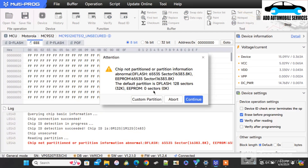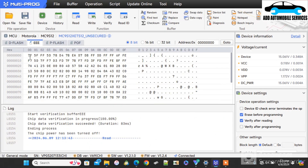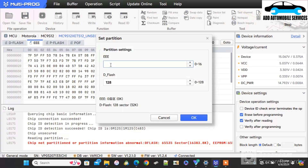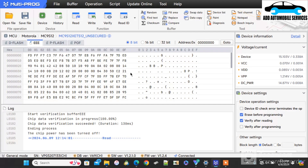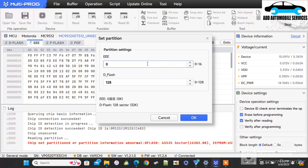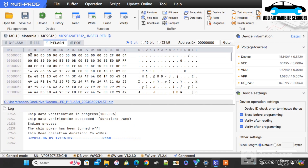When you are reading the EEPROM it tells you to partition it. Every partition has some data in there, so if you change the partition it affects the others — all of them have some data in the EEE, which is the EEPROM. You can go from partition 1 to 16 and all of them have data. But what we needed was the P-flash, because it has an external EEPROM which holds the data.